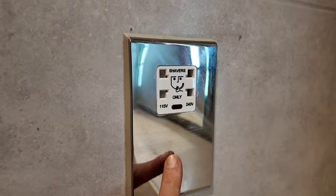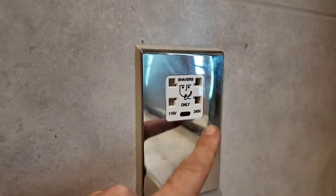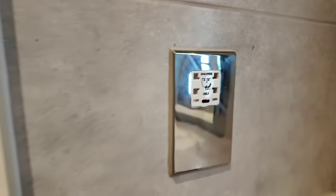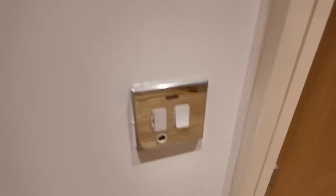Sometimes transformers like these can drag readings down, and this one has a neon as well. If it's dragging the reading down, we'll have to disconnect it from the circuit and link through. We've also got some fused connection units with neons on them for heaters, and anything that may be plugged in throughout the property. This is an empty property, so it's a little easier — in an occupied house you can struggle to find the one thing that's plugged in and dragging the readings down.